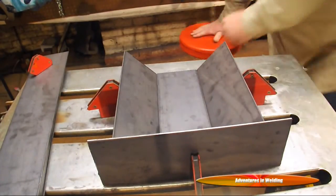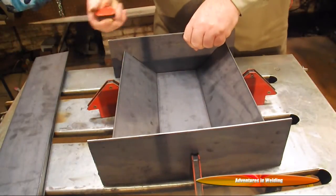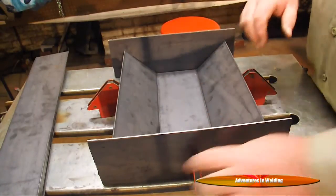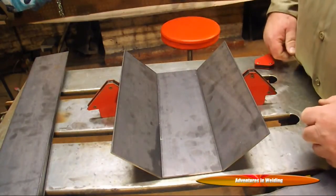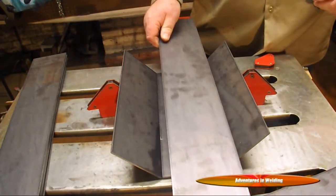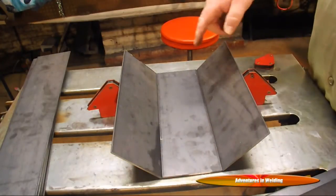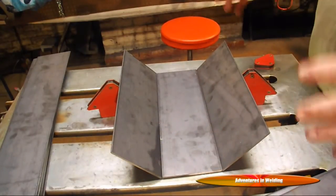We've got plenty of magnets. Here's the front of our grill — we'll call this one the bottom. There are our sides. We're going to form the grill out of these 4-inch steel pieces. We're making this 24 inches long, so we'll be using longer pieces. I'm going to set my height and then tack these pieces together for both the top and the bottom, and then we'll come back and weld them out.